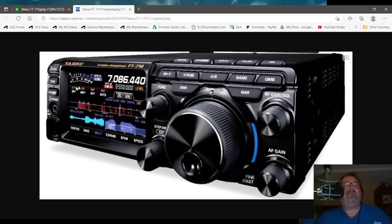Watch closely. Working my way from attenuation — that's on the FT-DX10. IPO — that's on the FT-DX10. Roofing filter is not there. But look — digital notch filter, DNF. That's interesting. That is actually one of my criticisms of the FT-DX10: the DNF, the digital notch filter, if you leave it on, it distorts the receive audio of a sideband signal that's S9 or better — it has a tendency to distort those.